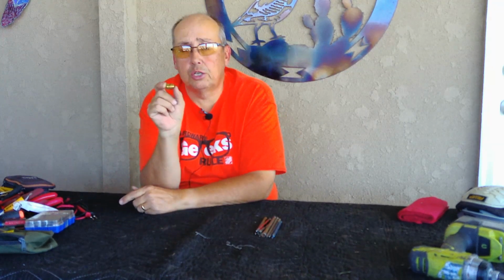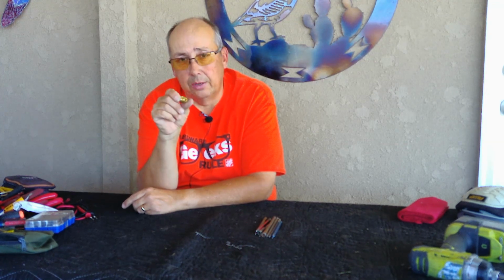I carry a 3/8 inch plug for LP lines. This is brass. You never want to leave a propane line open to the atmosphere if you're working on it. Take something apart, put a plug in it, and then put it back together if you're going to be delayed at all on finishing that job. Spiders and some other insects like the smell of propane, so you want to close those up. And of course, for safety, you don't want to have somebody accidentally turn the propane on and have gas venting to the atmosphere.